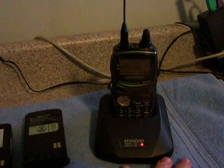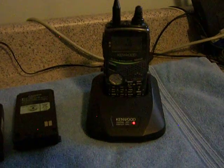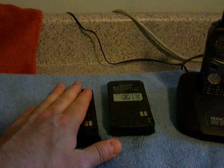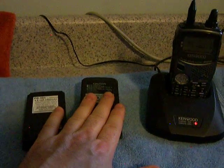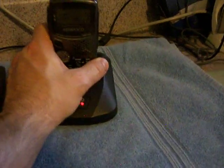The BC-19 charger works perfectly — you can see it charging a battery right here. This is a 1100 milliamp 9.6 volt battery. With a 9.6 volt battery it does the full five to five and a half watts depending on the band. If you use the 7.2 volt battery it does about three to three and a half watts. This is the 9.6 volt, so it'll do the full output. Just to show you — the display does work and it does light up.